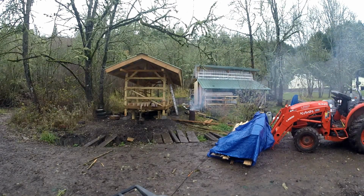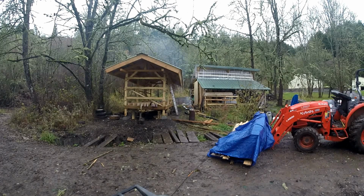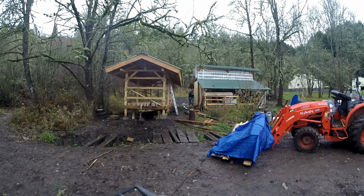Some wood species are more susceptible to this metal staining than others, but so far all of them have had that problem, where wherever I've put a board directly on the pallet forks for any length of time, like more than, I don't know, half an hour, I don't know exactly how quickly it starts to show up, but especially if it's been there for a day or two, wherever they're touching that metal, it turns black from staining from the iron or something. I don't understand the chemistry of it, but I know it's a problem, so that's one of the things that the pallets will help eliminate.